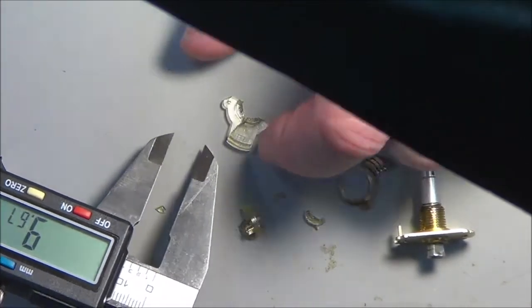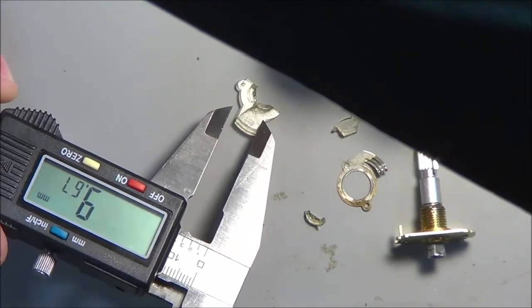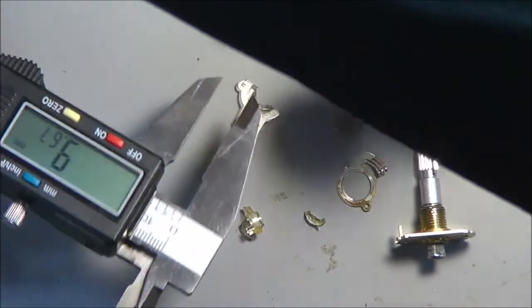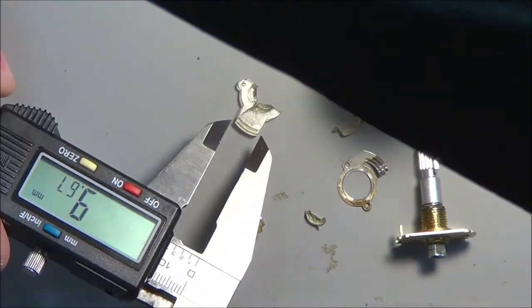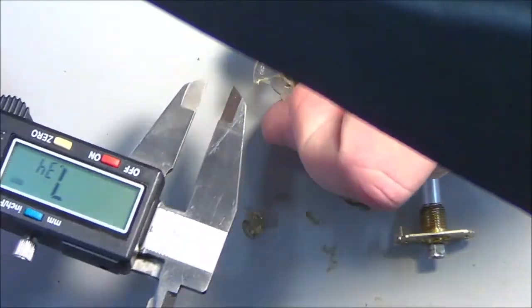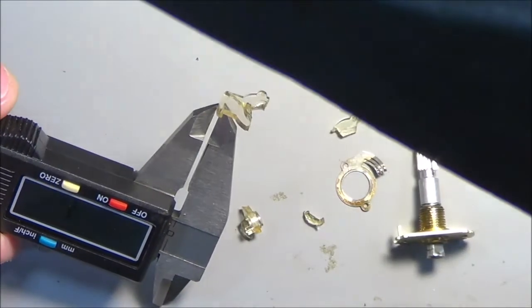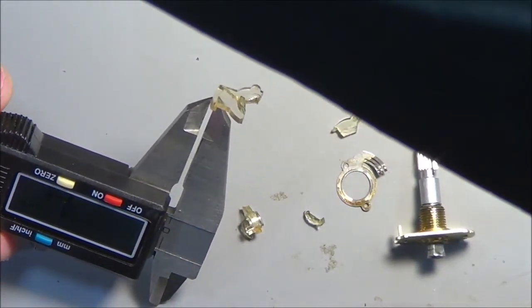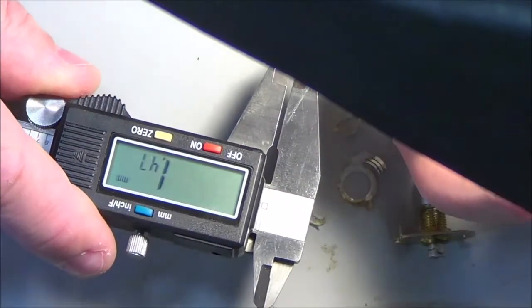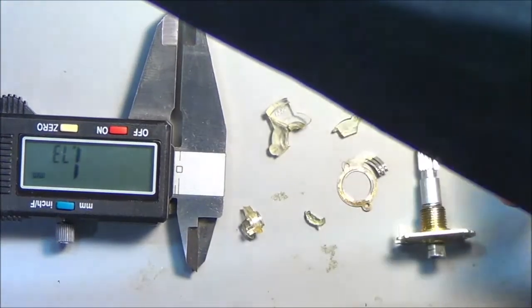Okay. And there's an arc to this, but I'm going to let that arc be the same as the arc to the inner circle. When it's expanded out, it'll still take the shape. I think the arc is the same angle and stuff. What I do need to have now is the diameter of this tab, which happens to be 7.6 millimeters wide along the arc, but in the arc, it's 1.5 millimeters wide.